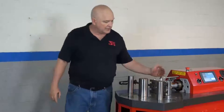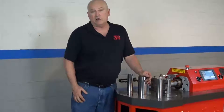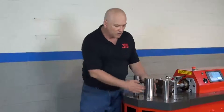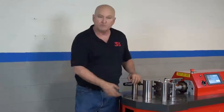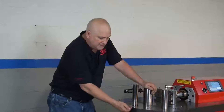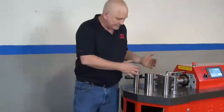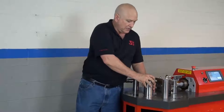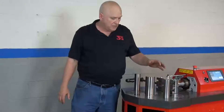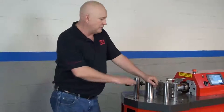The other idea of this hole in relation to pins is we manufacture a V pin. If you've got the female V die extended out and it's going to bend, you may want to bend back around yourself. We also can water jet custom parts for you in-house. For things you want to wrap around the pin, we use the second hole with a dummy pin that drops in but doesn't extend above the surface. There's a clamping mechanism you can easily reach through and adjust. Once we put the V pin in, we can center it into the female V die, and by locking that clamp mechanism, we prevent the V from rotating while still having full access all the way around the entire peripheral of the pin.